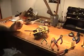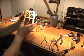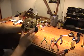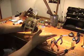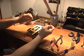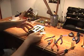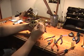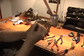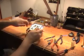We're a little closer now. As you can see, everything is exactly where it needs to go. The only part we have yet to put on has to do with the time adjustment. I've noticed a couple of spots that need some adjusting — we may have to pull it apart once, maybe twice. On this particular one, the locking lever is not locking exactly the way it should, and we don't have this gear lined up exactly right to shut off on time. We're going to make those series of adjustments, and then we'll be ready to oil.